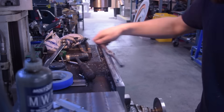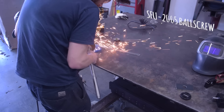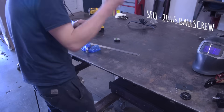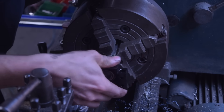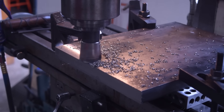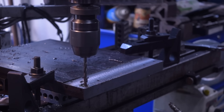I would have liked to scrape them in, but finding metrology equipment in Australia is about as hard as finding metrology equipment in Australia. I also cut the screws to length and machined the end to fit the floating mount. Making the intermediary plates for each axis was just a matter of milling flats, drilling holes, and tapping threads, until everything fit together nicely.